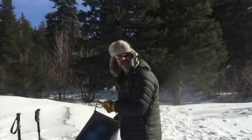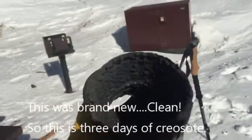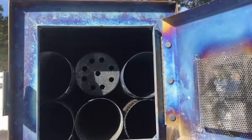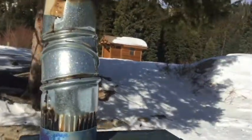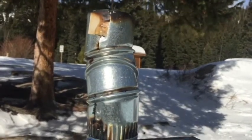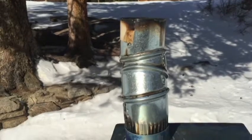You can see it clears out pretty good — most of that ash is from three days of burning. You can see that a lot of creosote builds up in this galvanized pipe. This swivel does have a hard time bending once the creosote gets built up into it. You can see all the pieces of pipe are cleaned and in the stove — they fit in there really nice. The only problem I had is with this swivel. Once it gets a lot of creosote on it, it doesn't want to straighten very well. I even replaced it. It does clean out, but I'm done with it — I'm not going to use it anymore. This piece of pipe had a hard time fitting in the stove because it just won't straighten up, and there's not a ton of room. I can get it inside the firebox, but I'd just as soon not have it.